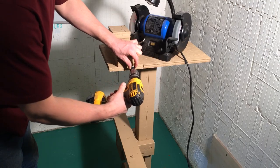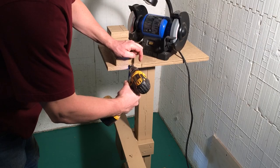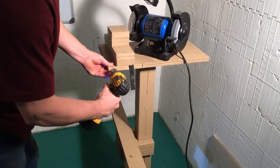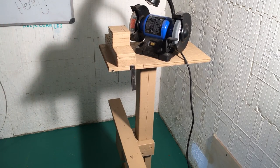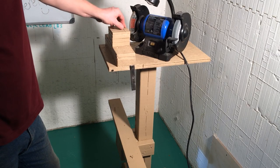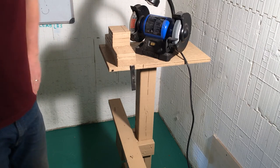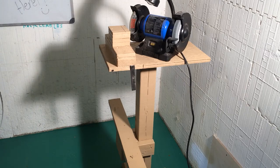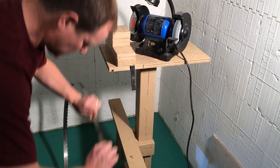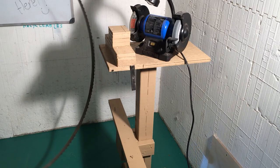I'll just attach this to the side because I don't want it to get lost. So now we're set to go sharpening. This is set up right now for summertime sawing. You have to change the angle if you want to do winter because the logs are frozen, and this is basically set up for softwood as well. You set your blade first and then you turn it inside out and set the other side. When you do the other side, the teeth have to be facing in the correct direction, which is inside out.